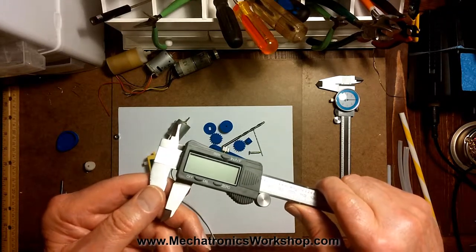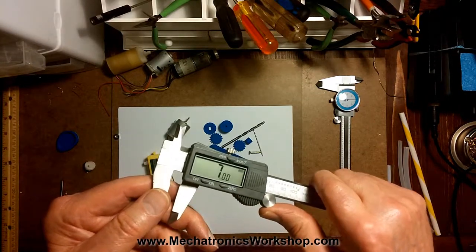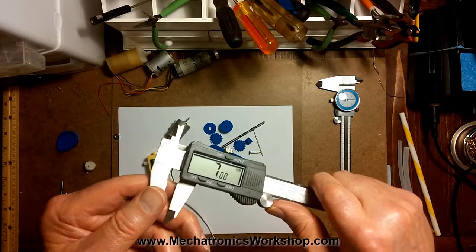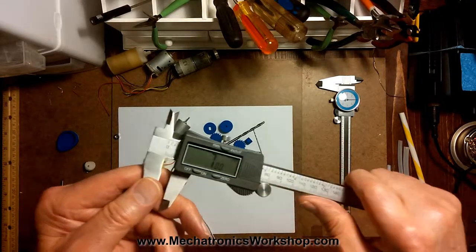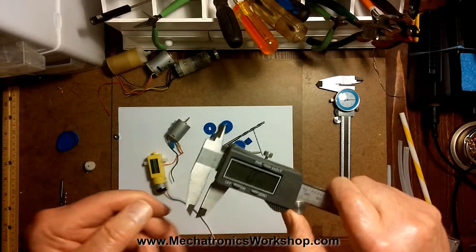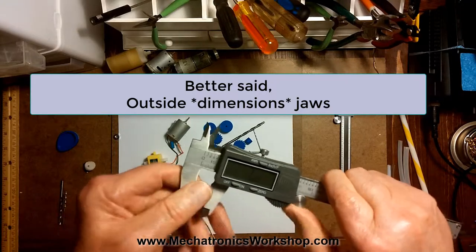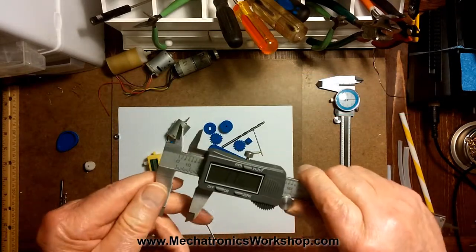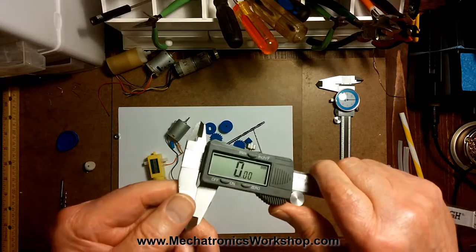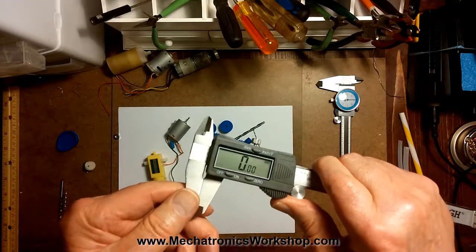So you can buy a lot of batteries for that price difference, but that's up to you. Just be aware that this thing is going to go through batteries quite quickly, so you'll want to have some spares on hand. Other than that, it's a wonderful tool. Probably the most common use is the outside diameter jaws. First thing you want to do is make sure that your jaws are clean, then close it up and check your display to make sure it's zeroed. If it's not at zero, you can push the little zero button and zero it.